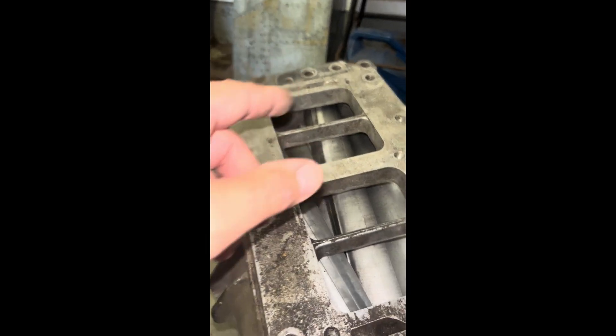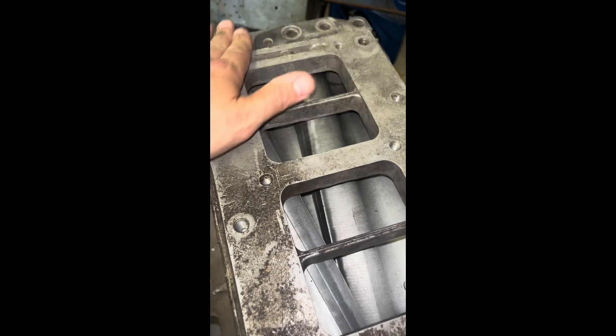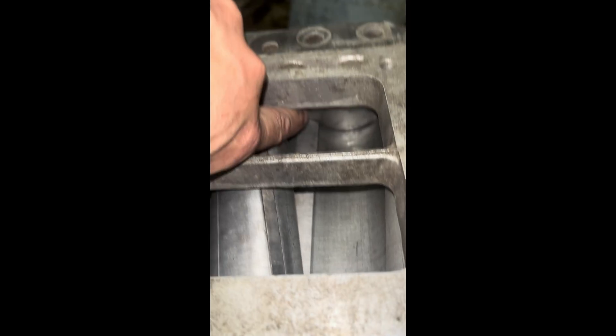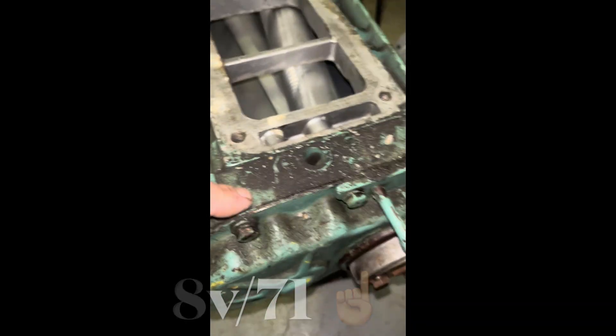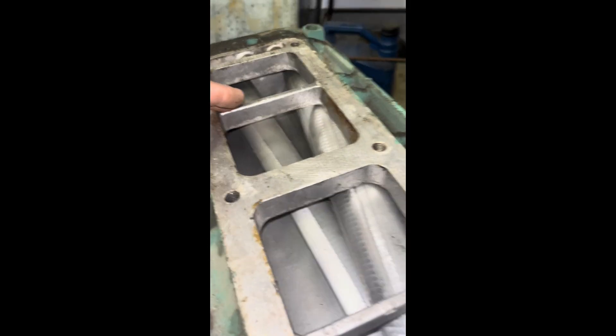They'll be a cutout on your face plate, your end plate, and it'll come out here. So try to avoid the Detroit blowers with that big center gaping bypass hole outlet. You can still use those blowers for everything else besides that end plate, and some people even still run it with the bypass sort of shut off. But you'll see the face plates here — there's no cutouts, there's no outlets. This is a true closed-off Detroit blower. It's only got the small holes, no big gaping thing there — the face plate all closed off. This is a non-bypass V92, 6V92 actually.